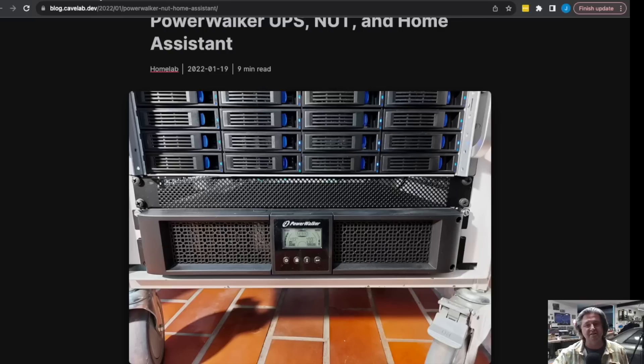So if you can get a UPS that does 240 volts, bring 240 into the room, run all the computers off 240, and bring in a neutral to give you 120 just in case — that's great advice for building a more efficient lab. The next big question is how do you cool it, so for the next video we're going to talk a little bit about cooling the home lab.